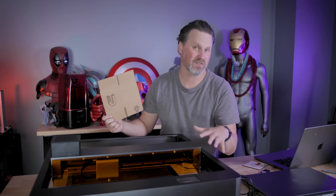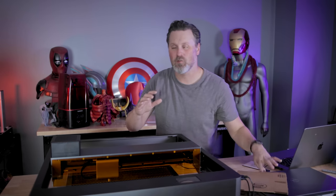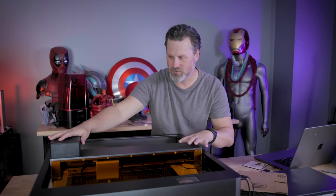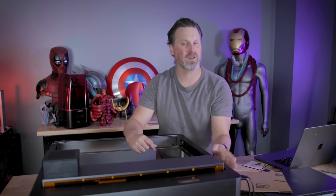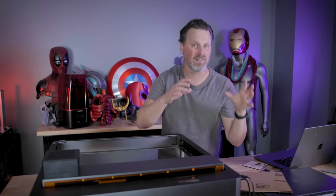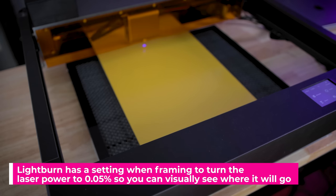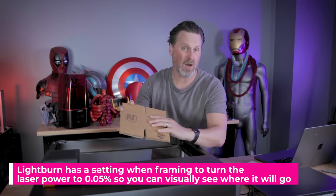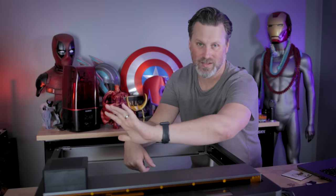If you're like me and the Fecta is your first laser engraver, you might be wondering how to position the object you want engraved within the build volume. What works best for me is to push the whole gantry system all the way forward with the laser diode in the front left-most position before powering on. Then I connect to the computer, power on, put my object in Lightburn, and hit the frame button, which guides the machine into the position it's actually going to perform the engraving. If it ever gets out of alignment, I just power off, reposition to the front left, and redo the framing.